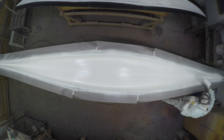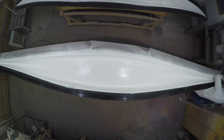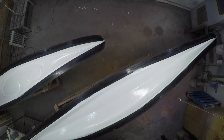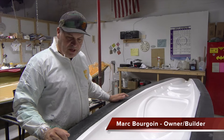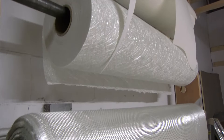I'm using about two liters of gel coat and it'll take me about 15 minutes to spray, about 45 minutes to tack up, and once we get beyond that then we can start to actually lay in the fabric. Now that the gel coat has been applied to the mold, I just sprayed the white hull and white deck, and I'm going to start applying the laminate.